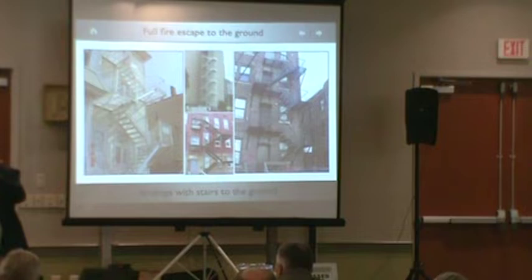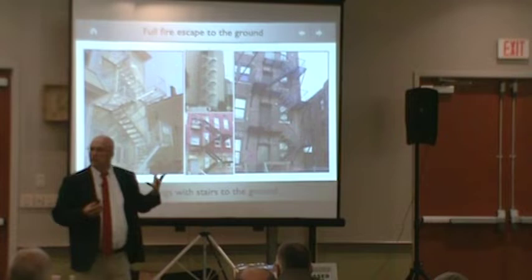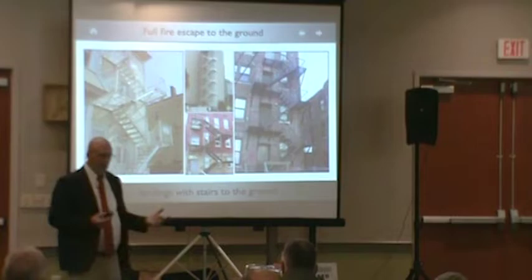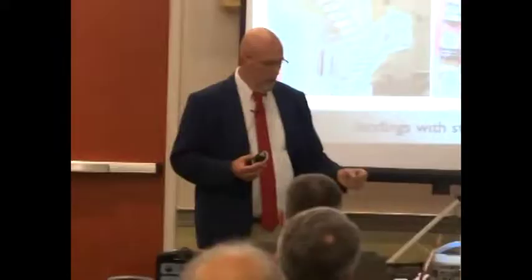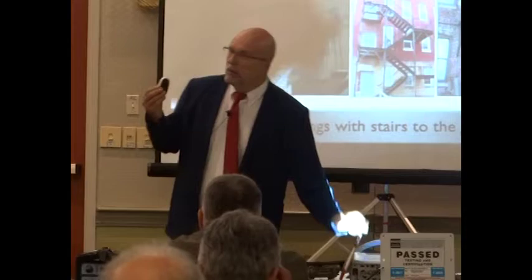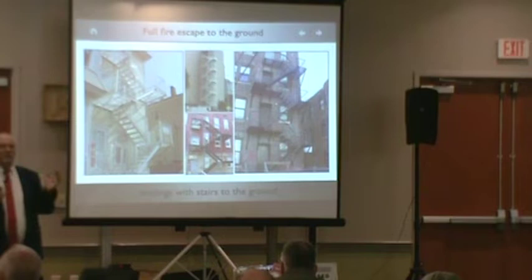The fire escapes here, and I examined this fire escape, guess what holds it to the wall? Lag bolts. We brought this up, I think it's in Taunton or Fall River, this fire escape built down in this area. There are still people using it. The key is, is it truly bolted with a through bolt, 1/2 inch, 5/8 or 3/4? This one was lagged. So that's all it needed, the rest of it was fine. Understand? So can you build an aluminum fire escape? The answer is yes. So let's put a fire right here.